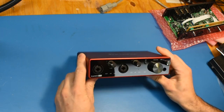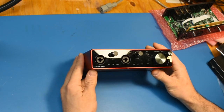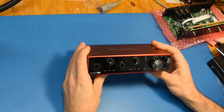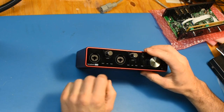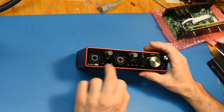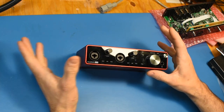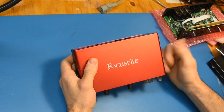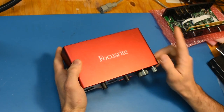The few that I've repaired, most of them had a dead CPU. The main symptom varies — sometimes you'll plug it into the computer and the 48 volt button will work, like it'll turn on and off. Some indicators may turn on or not; sometimes all the LEDs turn on and nothing happens. What is constant is that the computer won't recognize it, and sometimes the OS — if you're on Linux — will report an overcurrent fault.